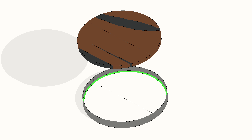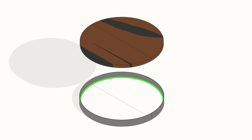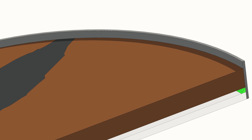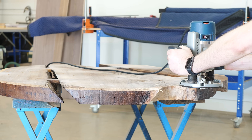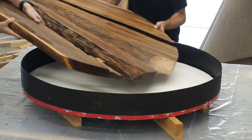And this is where the problem arose. The slab and the form have the exact same radius — that means it should fit right in there. The thing is, to make the form actually work, you need to seal it up, which we did with a bead of caulk running along the inside of the perimeter. So when you go to set the slab into the form, it's going to sit up about an eighth of an inch off the bottom. Our solution was to route a small chamfer along the underside of the slab, which won't affect the final piece at all. And now we have a nice tight fit.